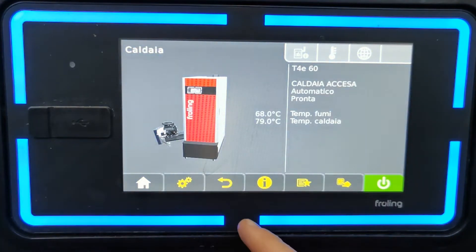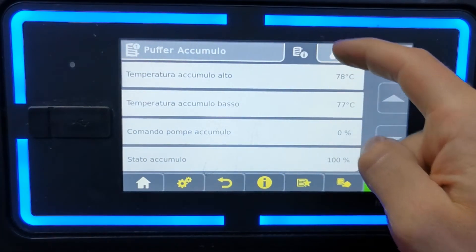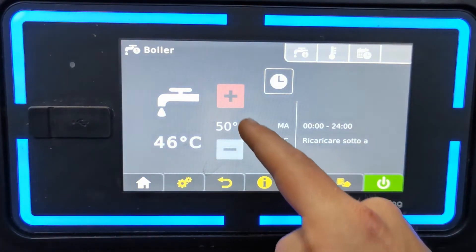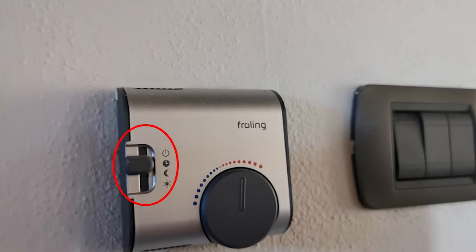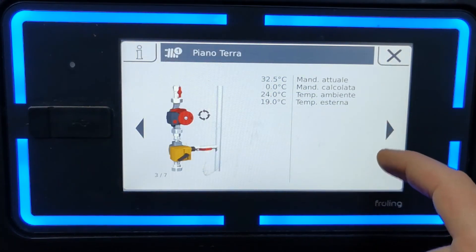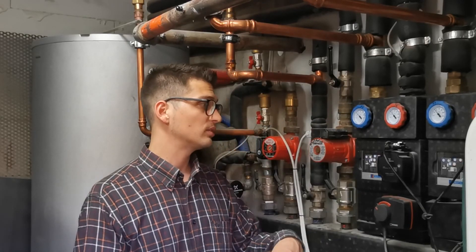Finally, at the machine interface on the boiler panel you have access to all the pages to set parameters: desired temperatures for the house floors and also the temperature for the sanitary water. You can also choose different heating time slots independently for each floor. Remember that there are also thermostats — temperature sensors inside the house — that not only sense temperature but also have a small selector letting you turn the heating on, off, or set it to standby, to control the heating system for each floor without needing to come down to the central control here. This concludes the video description of the piping and instrumentation of our heating system. I hope you liked the video and found it interesting and helpful — please like and subscribe!